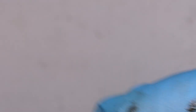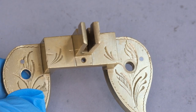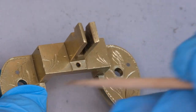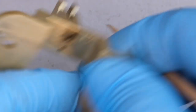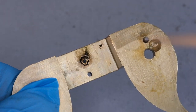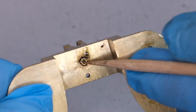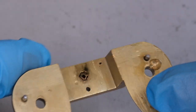Looking at the back cock, on the inside we can see that there are two bearing holes, which ties in with the fact that the clock appears to have had a new escape wheel — the second one being significantly larger diameter than the first. This is pretty typical for a clock of this period to have had at least one new escapement, if not two. Some clocks a bit earlier than this originally had a verge escapement — a completely different kind. This one, I think, has always been anchor recoil.